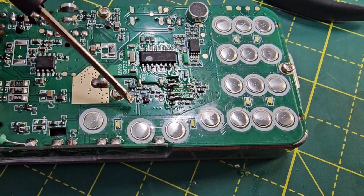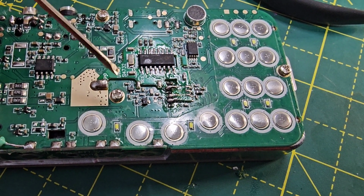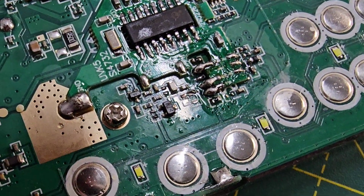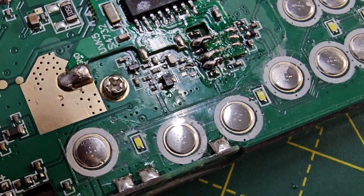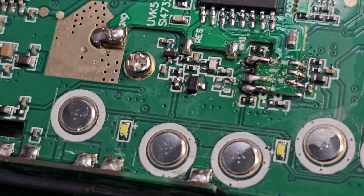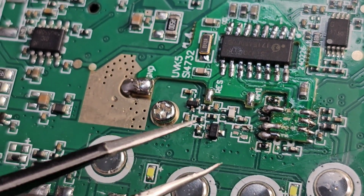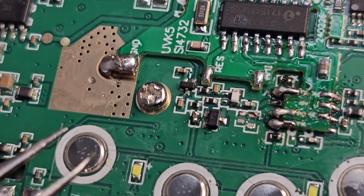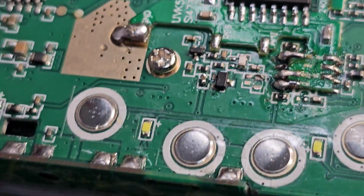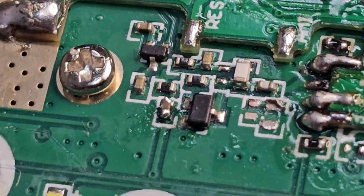So this is the tiny chip we've got to move. So let's just whip it off. I might even use snips. Yeah, snipped it off, then added some solder back on. Well, I think I got it on there, but it's so small. But you can see it's there. I just held it with tweezers and dabbed it either side with some solder. It's really hard to tell if it's on there, but it's not moving.